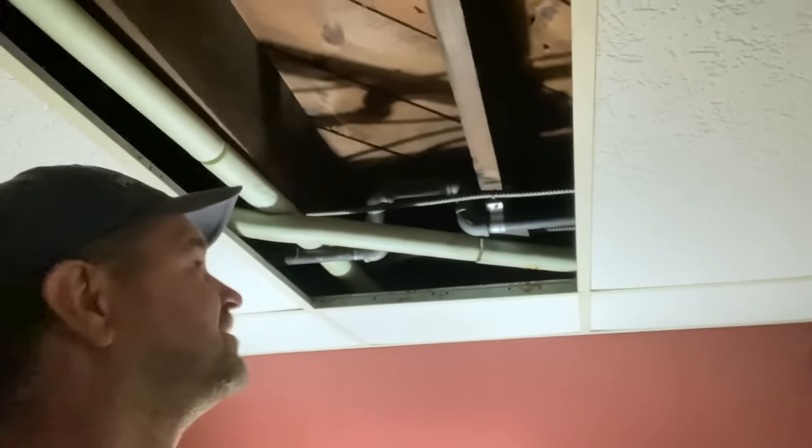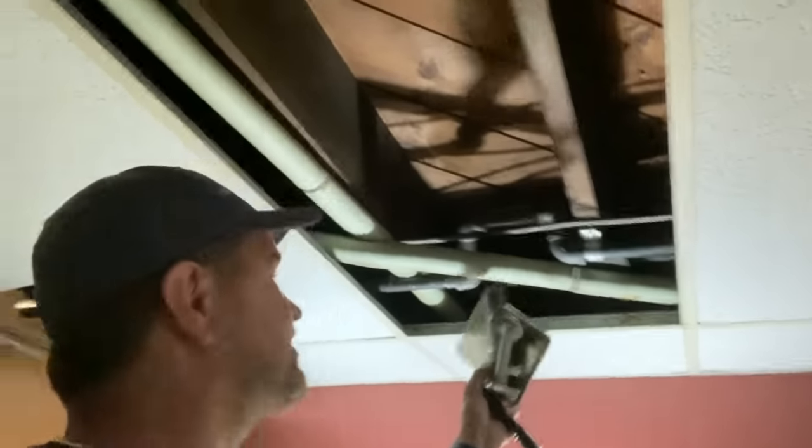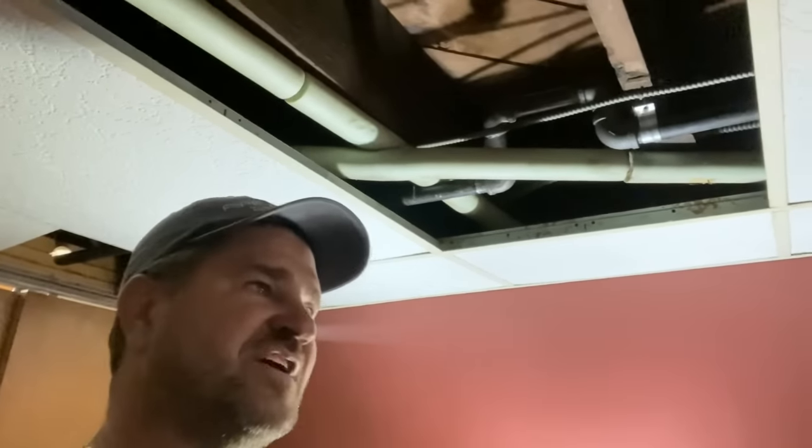See that? We call that an elbow break. Why do we do that? Well, because we're idiots. No, because we had a 3/4 inch pipe here and a 3/4 inch pipe there, and we were not getting from point A to point B without crossing C and D. So we did that. And it works. And we have 105,000 BTUs at 17 feet. We're golden. And we're golden according to the International Fuel Gas Code.